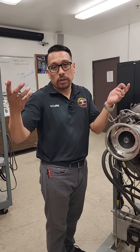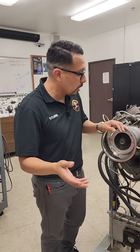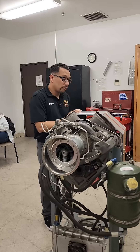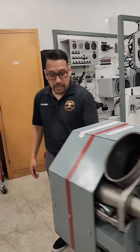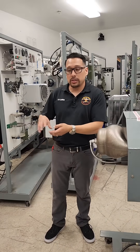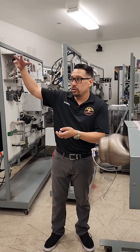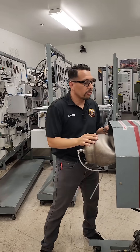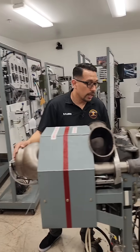For a helicopter, that shaft is splined to the main transmission, and then you have your main rotor and main rotor blades — that's what drives the main rotor. On the aft part, there's another shaft splined to the engine, which connects to an intermediate gearbox, then the tail rotor drive shaft, then the tail rotor gearbox, driving the tail rotor for anti-torque.